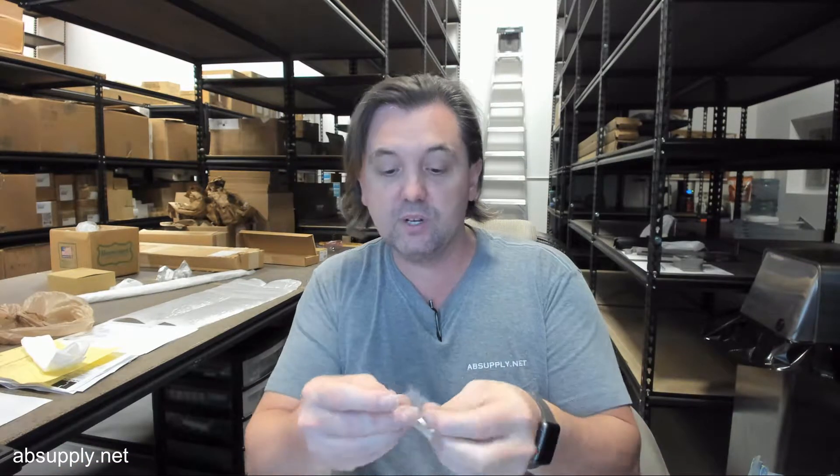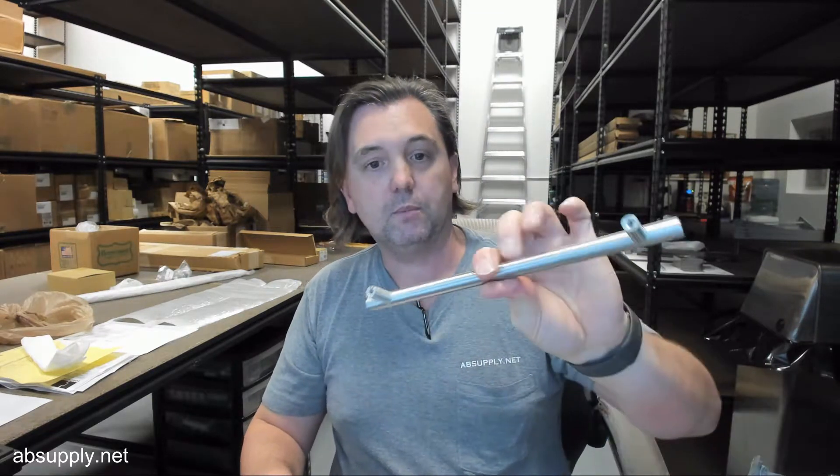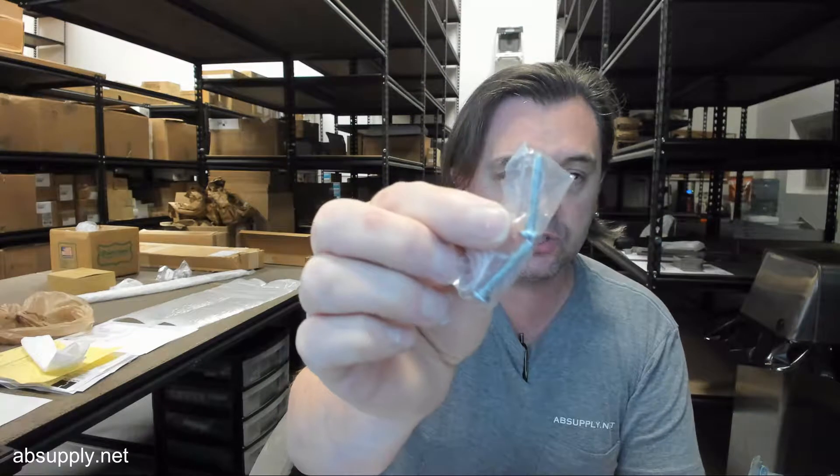Back to the extended description: the product brochure and mounting drawings are linked below. The RM1200 is a type one mount only in terms of installation method. The only way to mount these is with 8-32 screws that are one inch long — typical for three-quarter inch drawer or cabinet fronts. If you have a thicker door, we can supply you with longer 8-32 screws; just reach out to us and we'll quote those. The printable cut sheet is also there, which is what you'd find on the Rockwood website.